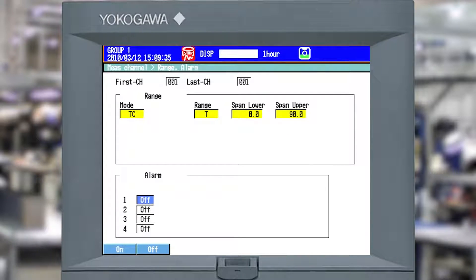If it's showing a default Celsius range for type T thermocouple, it means you probably haven't gone into basic settings environment and changed from the factory default - which ships as Celsius - over to Fahrenheit. If yours is showing Celsius spans instead of Fahrenheit spans when you pick a thermocouple or RTD, go into basic setting mode by hitting the menu key and holding the function key down for three seconds. Under the environment tab you can change that. Make sure this is one of the first things you do when you get it from the factory, otherwise it will reset all your settings at this level if you later decide to change from Celsius to Fahrenheit.